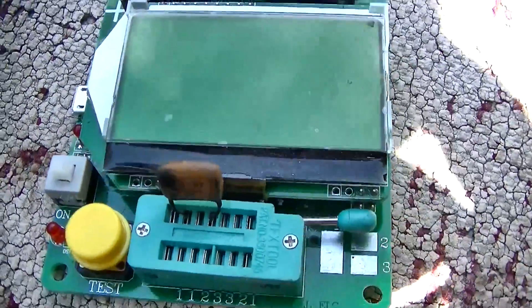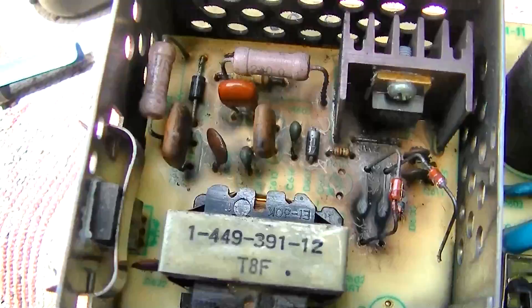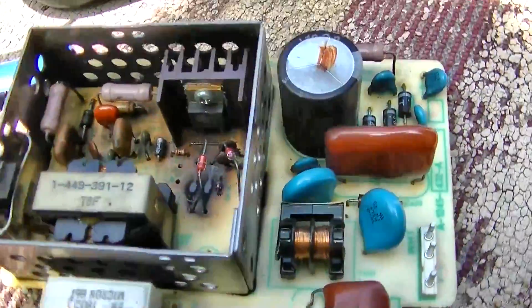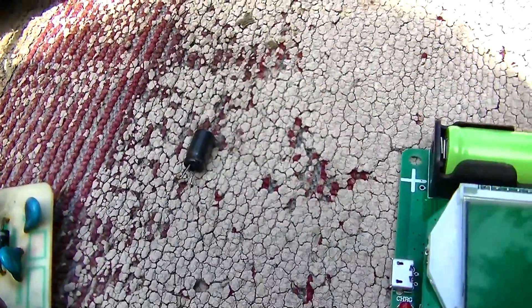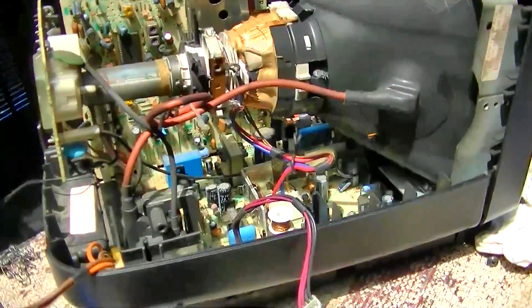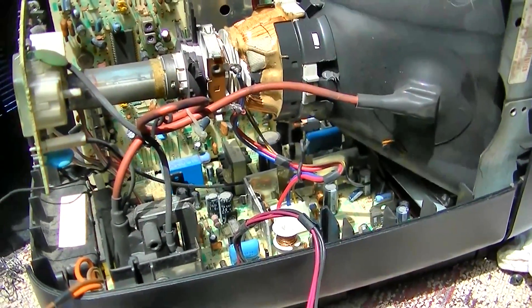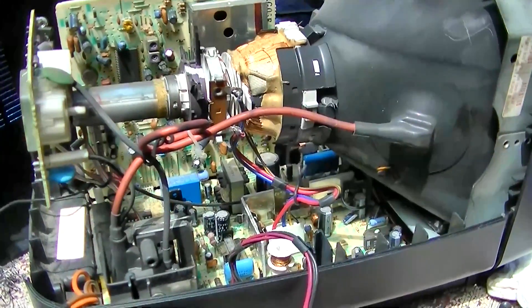There was actually nothing wrong with that capacitor — that was a blob of wax on the side of it. But I went through and removed every single component: every disc capacitor, every resistor, every diode, and I checked all of them and put them all back in. Everything checks right on the money except the small electrolytic I replaced last time — the ESR is up to about 20 ohms, and it should probably be under 1 ohm. I think if it's still getting too hot, I'll just get a 12 volt wall wart. First we'll test the TV on batteries to see if it got hurt when this screwed up.